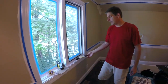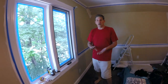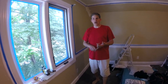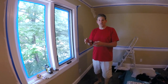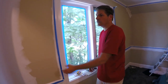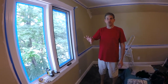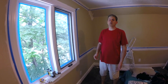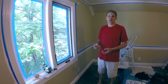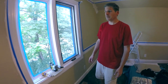The next part is to get your roller. The rollers come with a three-eighth inch nap or half inch — half inch is more for a rough surface like maybe brick or something like that. For walls, three-eighth inch nap or less carries just the right amount of paint to not overdo it. It's probably worth paying for a decent roller as opposed to the bargain-based one. It'll give you a nice consistent look — it's worth the extra two bucks or whatever it might be per roller.